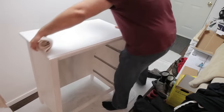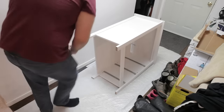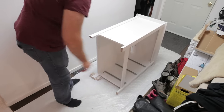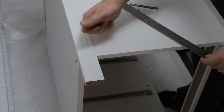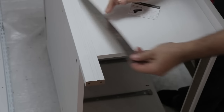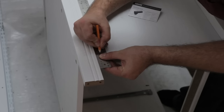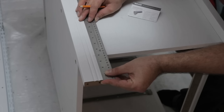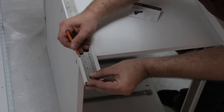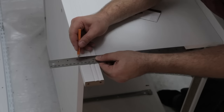With the whole thing assembled, it's time to move it over so I can cut the legs off to the final height. We wanted the finished vanity to be a few inches shorter than this dresser, so we took our final height, measured from the top down, and made a mark. That happened to be about a half inch below the bottom of the cabinet. I then measured how high that mark was from the bottom and transferred that measurement across so I was able to draw a straight line.